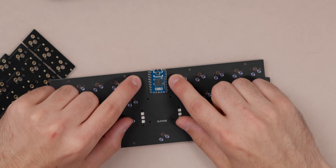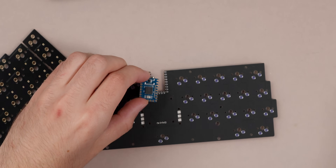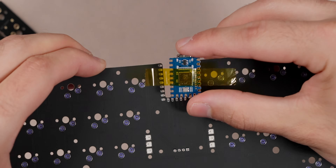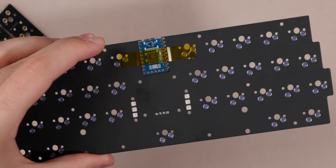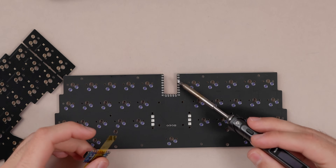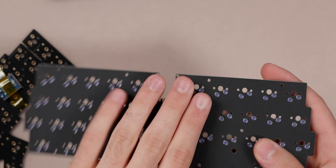You're probably wondering how we solder this onto the board. It seems a little complicated but it really isn't. We grab the controller and a piece of Kapton tape — basically heat tape — and just tape it onto the board. The holes on the controller align with the holes on the PCB. You tape it down, put your iron in that little notch, and feed solder into the hole and it will just flow. I also recommend using a flux pen on these pads to help it flow a little better. Then I'm just going to go through and solder this on — that's really all there is to it, other than the little OLED which is through-hole.